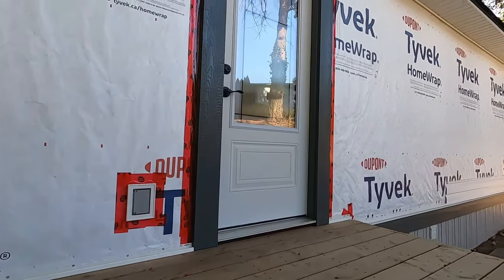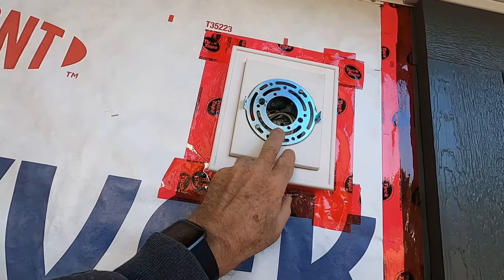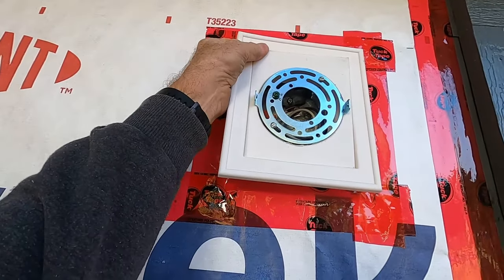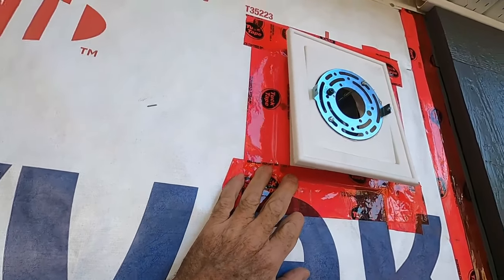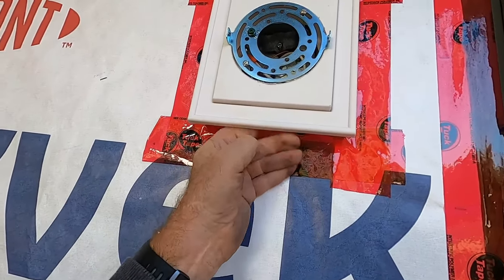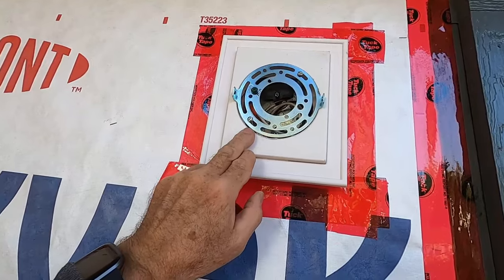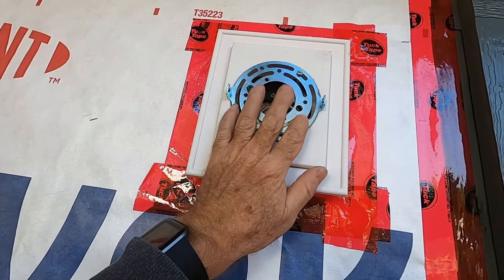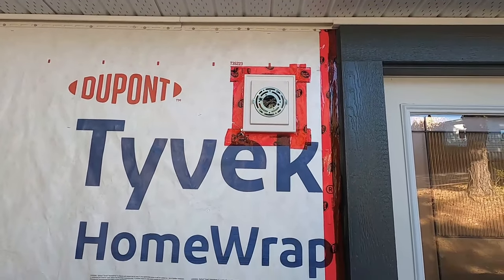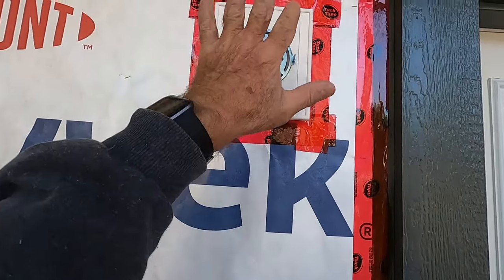Likewise for the light, we've got the same deal with a mounting block. The siding will slip underneath there — this thing just snaps off for installing and gets nailed to the wall, and then I seal it over. The reason I have part of the lamp on there is to think ahead — when I put my fixture on, I want to make sure everything's going to line up so my fixture is in the middle of the block. If you just guess at it, you can end up having your fixture off center. But yeah, I'll show you that — that's how you handle things for lights and plugs. The plug is installed and now the light will be installed on top of this.